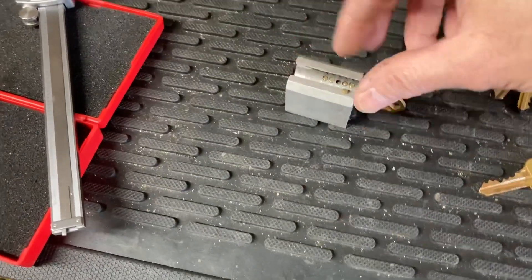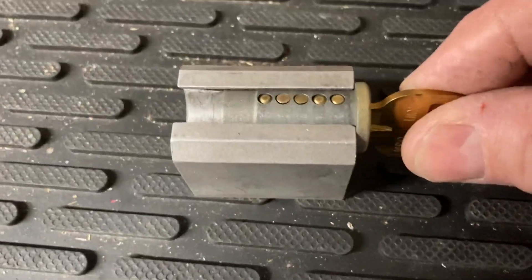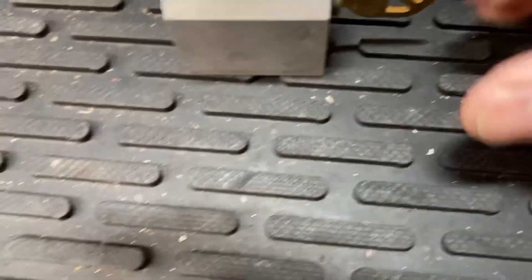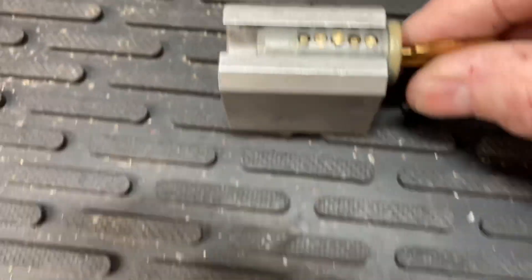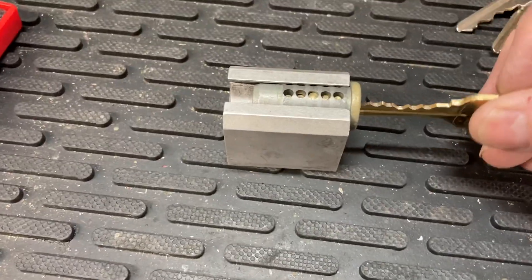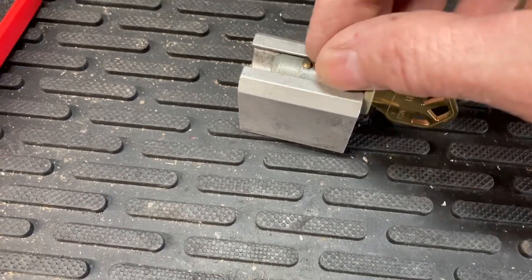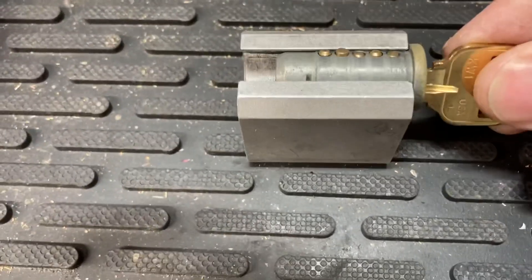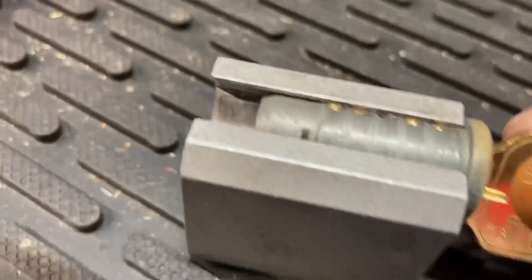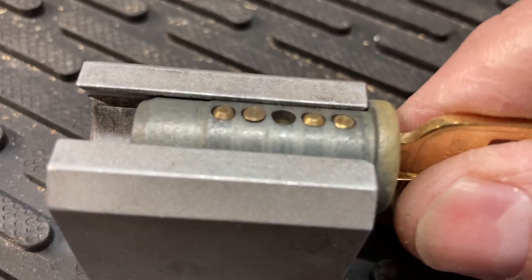Though you'll see the difference. I think there's a master pin right there — I've got a mixed mosh of different pins. You'll see the tapered pins and the standard pins. So when you put this in, you're going to see what happens. I'll take that out. See? It won't — see? It doesn't let them go down far enough because the root opening is not wide enough.